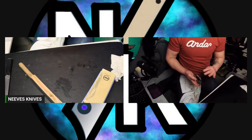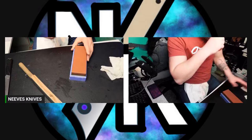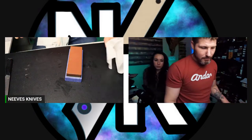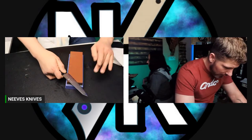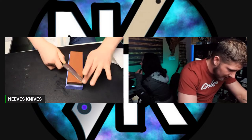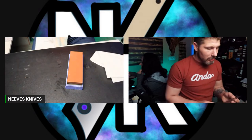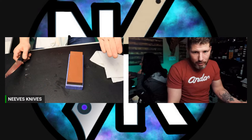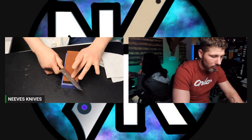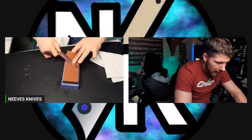But we are going to quickly, because these stones, I could probably, so like, let me just be clear. I always say don't ever start higher than like 300 grit to reprofile. But if your edge is already set, like you already have your bevel set, like on this one that's been sharpened before, as long as I can find that angle nice and quick, I can definitely just start from 1,000 and then go up to 6,000, as long as it doesn't have any damage, just to recreate a burr and knock it off. I'm not trying to reprofile, I'm not trying to do anything but keep the same angle, create a tiny baby burr, and knock it off really quick.